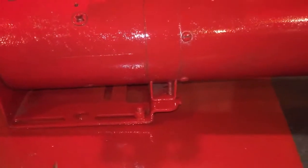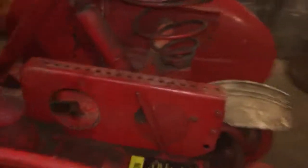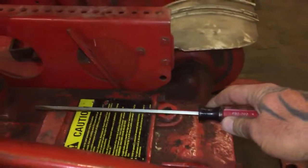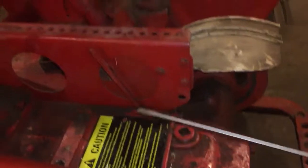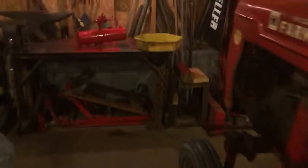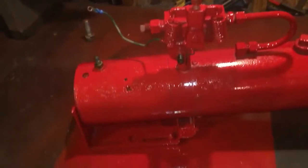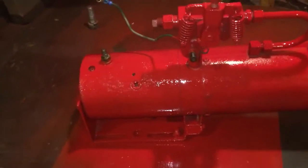Here's the mounting holes right here where the bolts will go down through to that boss. And then basically what I did was I just put two little nuts, one on each side there, and basically what they do is they take up the space. That's kind of where they rubbed on them stickers there, but that will keep the pump, when it sits on here, it has a tendency just sitting there static, it just kind of wants to fall. So I'm hoping that with that bolted tight there and them two little nuts kind of holding up on the back side, it might cut down on some vibration, and hoping that it will avoid any cracking in this plate here. If I run into something like that, it's not a big deal. I can put a thicker plate on the bottom and weld it to it and redrill the holes. We'll be fine.